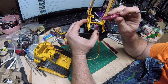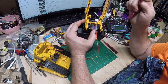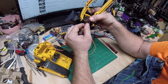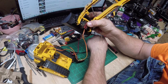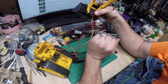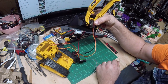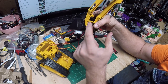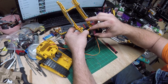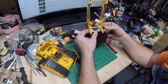I'll probably make some notches in this arm and hot glue the wire down in there - that's what I've done in other builds to hide the wire. I'll be trimming off this tab here so it doesn't interfere. When I buy these I buy them in a pack of eight - much more cost-effective in bulk. If I'm at an RC truck and construction event and one breaks, with a hot glue gun and probably 10-15 minutes I can have it swapped out. So I'm gonna go ahead and get that screwed into place - glue it in and screw it in.